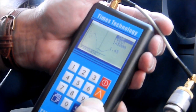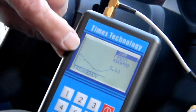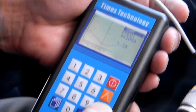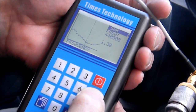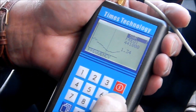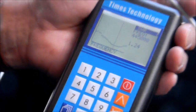We got a good match at two meters. Now let's go up to the high band — 400 megahertz. There's our 400, and we scan: at 400 megahertz it's 3.57, but we're going to move our line over to about 440 megahertz. At the 70-centimeter band it's 1.38. This thing works great — of course if it's a quarter-wave at two meters it's going to be three-quarters of a wave at 70 centimeters, so it makes sense. There's nothing up there but that antenna; it's just a little 19-inch piece of wire, so it works great at both bands — pretty amazing.